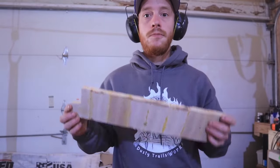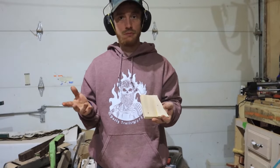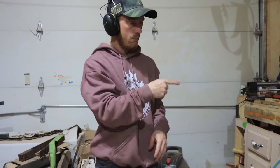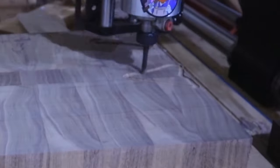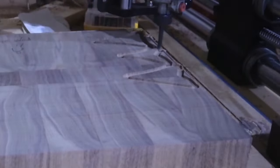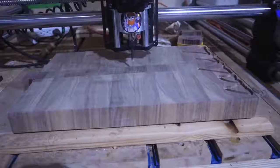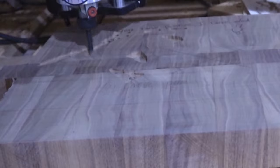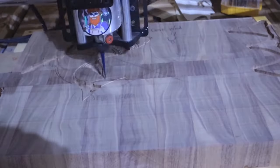Getting started with these pockets here, I'm going to start with the outline of the teeth. Here was my actual 0.25 depth of cut, where there's actually going to be, technically speaking, 0.02 difference for that wood movement and the glue to sit in from the pockets to the plugs. Moving into it, this is the rough clear of the shark with my 1/4 inch end mill and also my 1/16 ball nose bit. Sending you back into the carve and tune section of this video, but realistically we'd be playing Jaws.